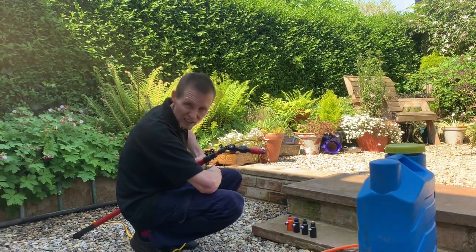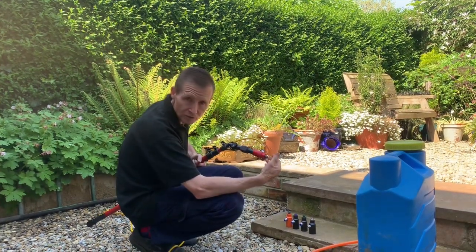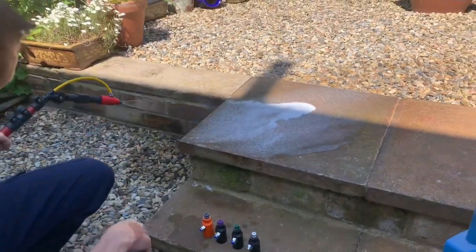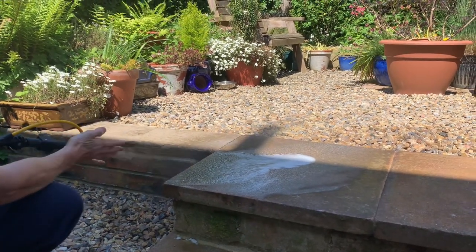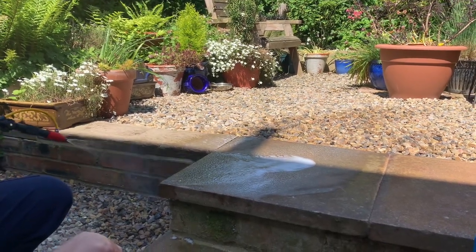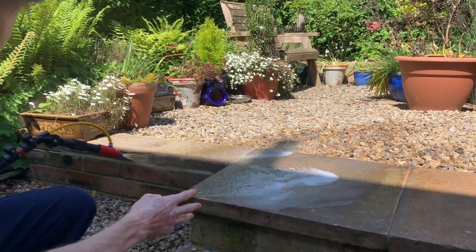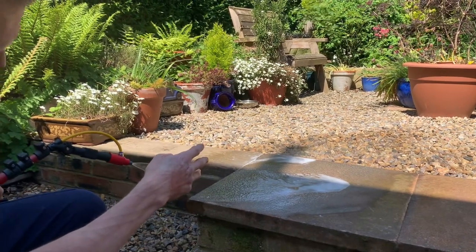This is fantastic for PVC cleaning, gutter cleaning, and applying the chemical to conserve your roof. So that's a fan jet nozzle — it comes out of the nozzle like a flat spray, like a fan jet. That's a 25-degree; this is the original one that we released. Then we got asked: do we do a wider spray pattern, mainly for when you do a big cladding job so you can speed the process up applying the chemical.